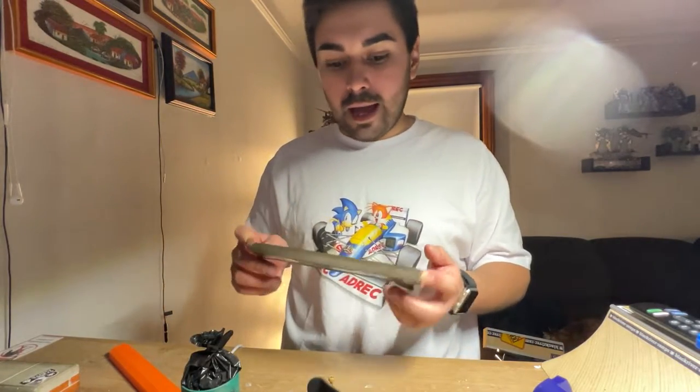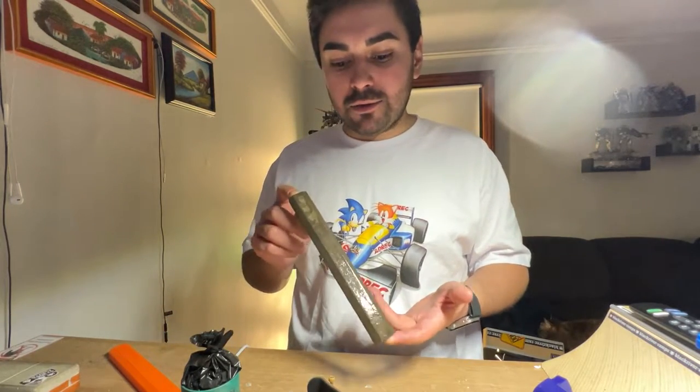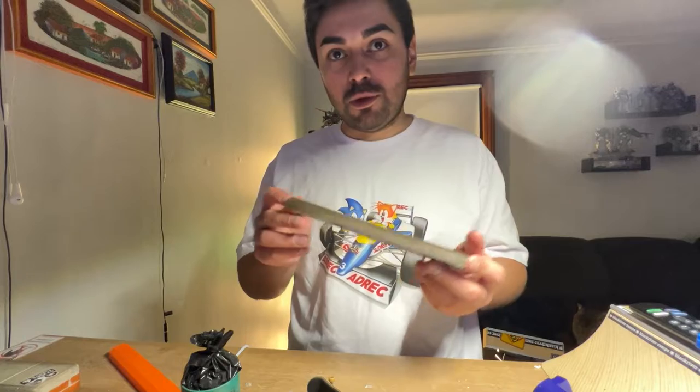My main concern was making sure I didn't have just a thin layer on the bottom of my mold - I wanted it to be substantially thick. That was a nice little hack. But in the end, I probably just used too much silicone - I probably could have used about half the amount in a smaller vessel.